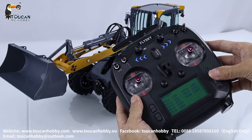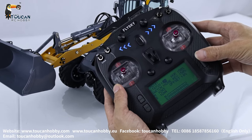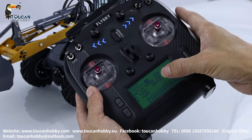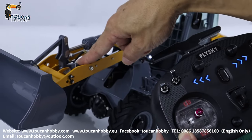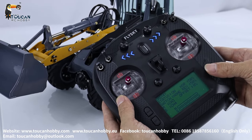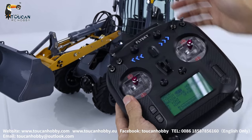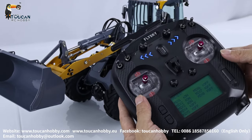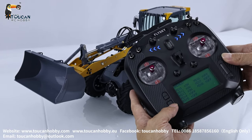If you want to switch on another mix for the spare channel, set it here: switch it on, negative 80% and positive 80%. Master is channel 10 (spare channel), slave should be channel 7 (the pump). However, it's better not to switch it on now, because if you operate it by mistake while not connected to attachments, there's no need to run it. Only after fitting with attachments should you switch on one more mix for the pump spare oil channel.